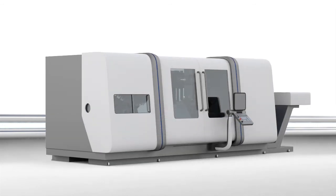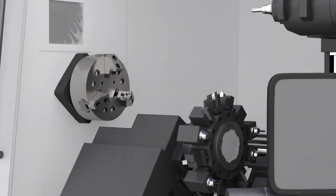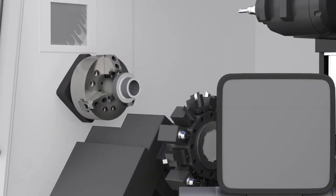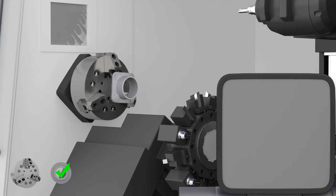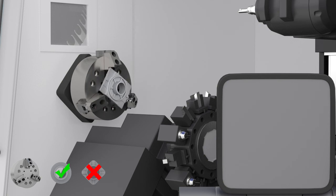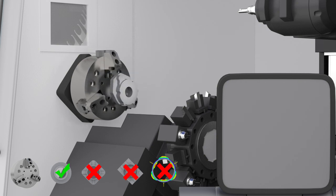Up to 80% of modern CNC machines are equipped with rigid concentric clamping three-jaw chucks. A three-jaw chuck is suitable for clamping round component geometries. When it comes to square or cubic shaped parts, it's impossible to get them clamped in a three-jaw chuck. Thin walled parts get strongly deformed in a three-jaw chuck.